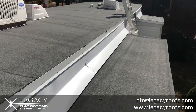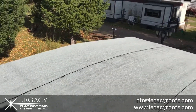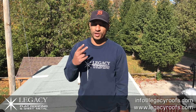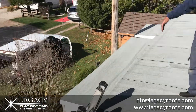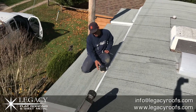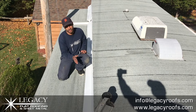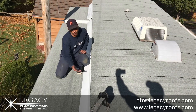Legacy Flat Roof and Sheet Metal — we went from a single-ply PVC roof to a two-ply mod bit roof. In Canada, with the hot summers and cold winters, you get a lot of expansion and contraction, so in my opinion a two-ply system is always going to be better than a single ply. We had a couple of vents to deal with. This is a trailer, so she had a few stick-outs. The detail on the stick-out was very important — we had to make sure driving rain and water didn't get in. That isn't the best watertight detail when the trailer is being moved, because it has to open and close, but now we've watertight it and put flashing so driving wind and snow won't hit that detail.